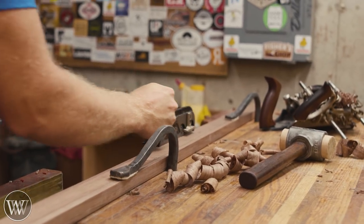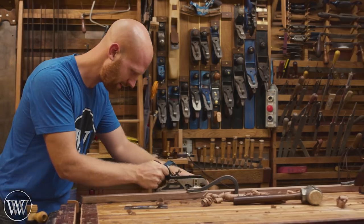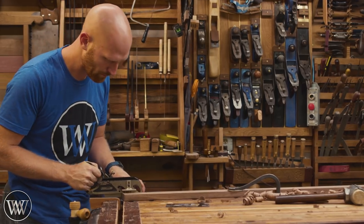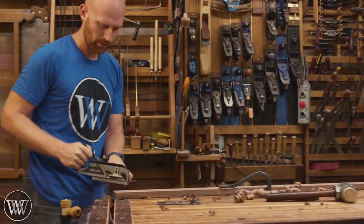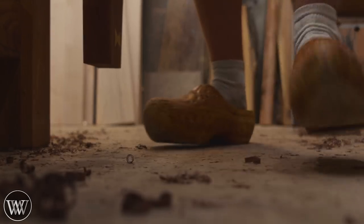The next thing I want to do is create a rabbet in the opposite corner. This rabbet will be what houses the picture and the glass — it's about a quarter inch by a quarter inch. Using a rabbiting plane with a shoulder and a depth stop just makes things so much easier to run that down the line in a nice clean line. And it's a lot of fun — great little curls that come off and act like little springs.